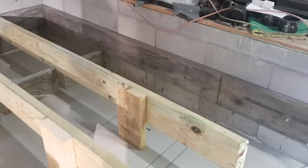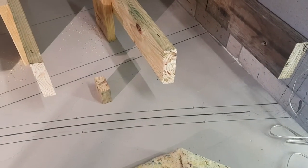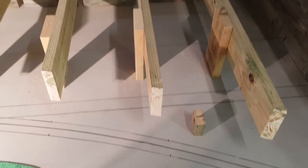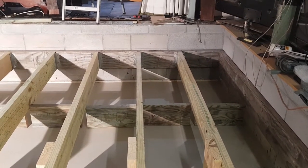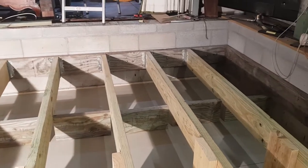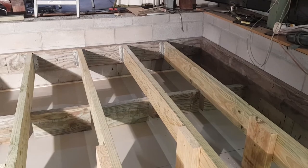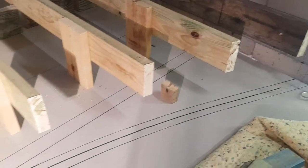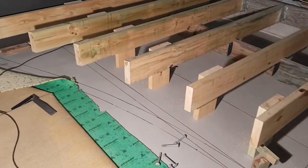I've got a bit of tweaking to do. I have to make sure that the front edge is directly over that first curve, and then I need to screw it into the saddles. At the moment, I can tweak it and move it back and forth. Once that's done, I will put the noggins in. In fact, I think I might get all these front pieces just positioned perfectly